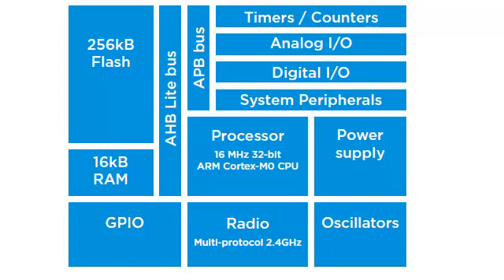In addition to built-in regulation, analog, and digital lines, it also has a software-controllable peripheral interface that enables it to remap any I/O pin to any other I/O pin. It also has a 2.4 GHz radio, which is compatible with Bluetooth 4.0 low energy.